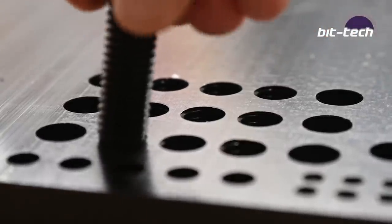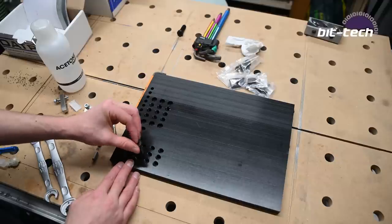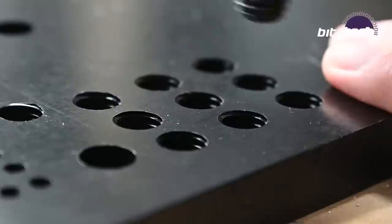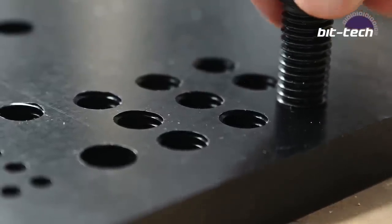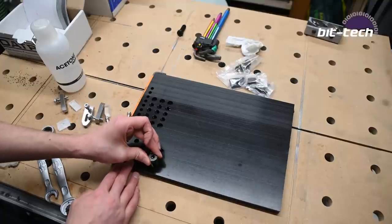So if we take a look, you'll see that on these ones, this screw just about gets in there, but it doesn't thread all the way in. And then if we look over here, the screw thread is starting to go all the way in. And I found this one here, which has a thread pitch offset of 2.25mm, works just right. Thread goes in, it's not too tight, it doesn't have any wobble when it's in there, and it doesn't go in with too much difficulty,